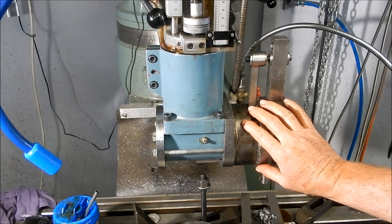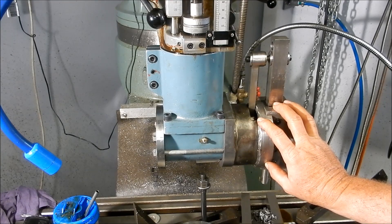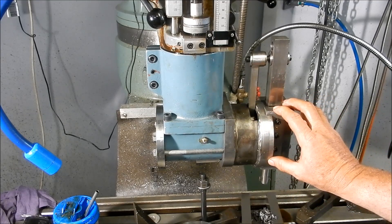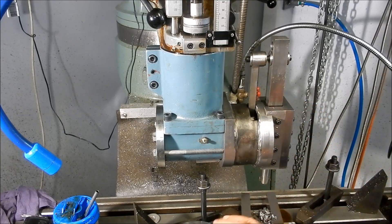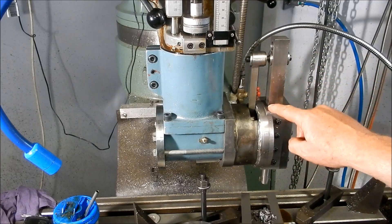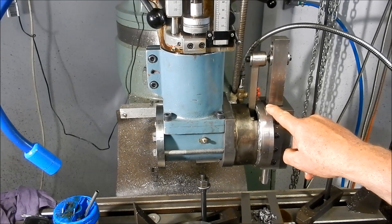It's even less rigid, so just need to take it fairly carefully. But it does a good job — infinitely variable stroke from 25 millimeters up to 76 or 77 millimeters. I can adjust the stroke fairly easily; at the moment it's set around about 65 and I think we cut 50 to 55 millimeters of depth there. I'll leave a link in the description to where I pulled this apart and did a full strip-down so you can see what the guts of it looks like.